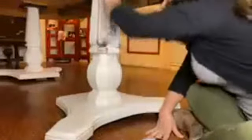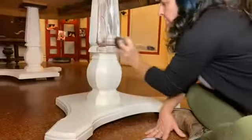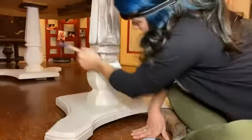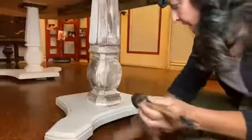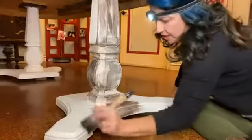Just tapping my brush in the brown wax and then I'm going to apply it — I'm a fairly liberal applier. A lot of people will be more sparing, but I'm heavy-handed; I paint with a lot of paint on my brush. I'm just rubbing it in — I want it to get in the creases of the table, all these little decorative lines. As I'm painting it on the part that I have not clear-coated, it's soaking into that chalk paint. Right here is the half-and-half line of where I've coated it in clear coat and where I haven't, so you're gonna be able to see the difference really well in a sec.